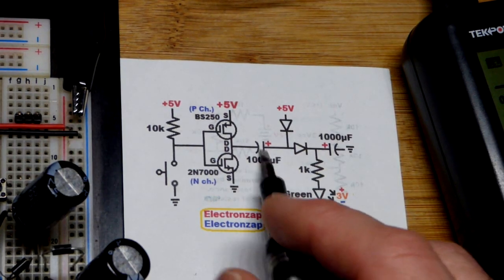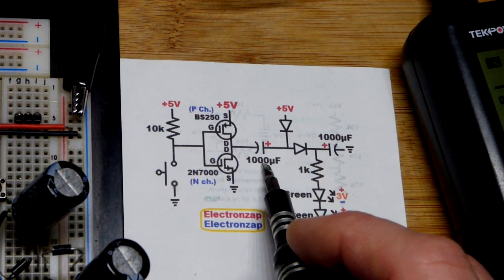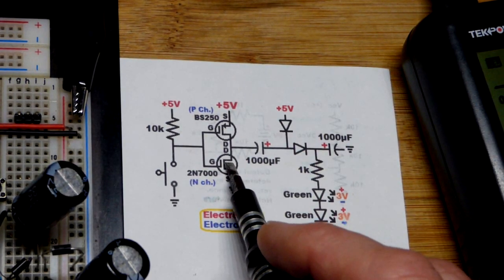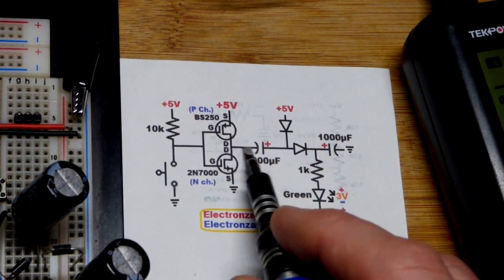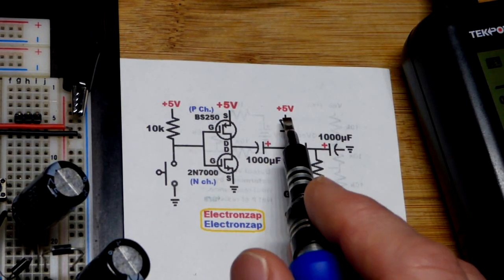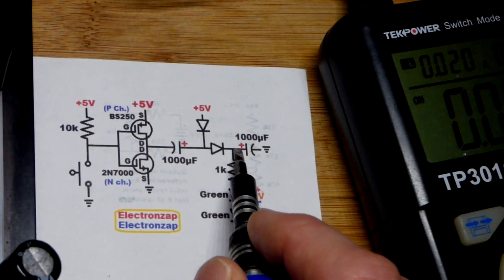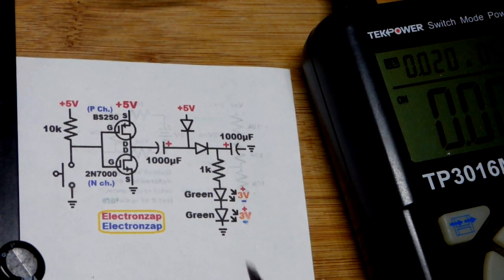Now we look at the schematic for the charge pump capacitor — a 1000 microfarad capacitor. The exact value doesn't really matter, but you'll store more charge with a larger value. However, you also have short circuit issues, so you don't want to go too large. When that transistor is on, the capacitor will charge. When you turn this transistor on — only one can be on at the same time — you turn this one off and turn this one on. You have a charged capacitor and a current path. Without the diode, it would just discharge back to itself. The diode stops that, instead letting current flow into the output capacitor but not back, so its voltage rises and it can power the load.